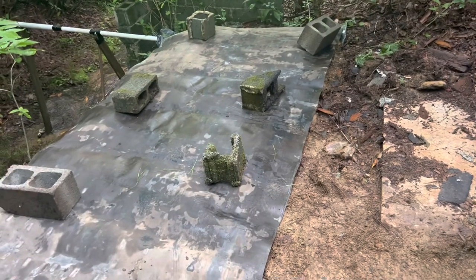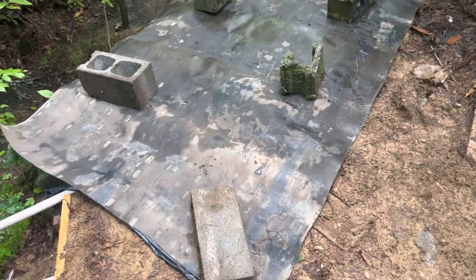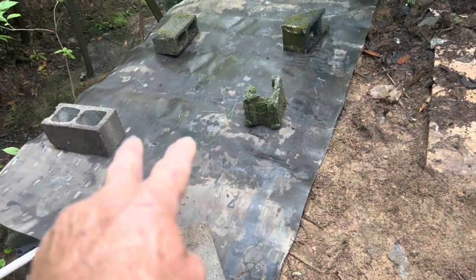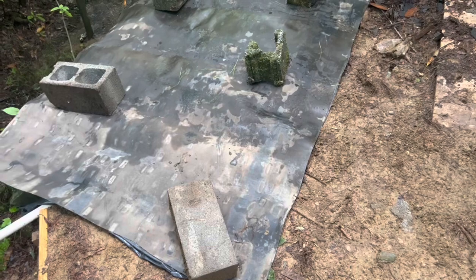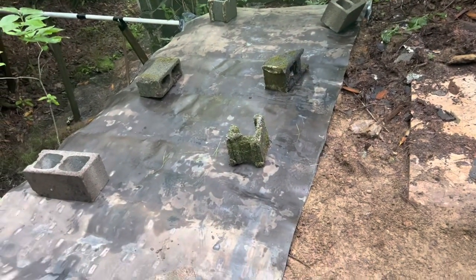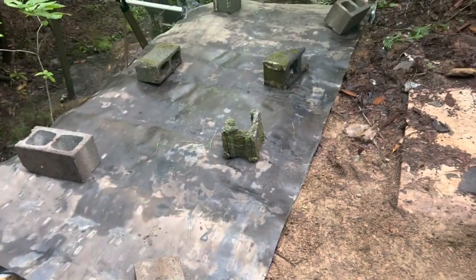I'm back here today regrading after six days of rain — about five inches. Hopefully all the trench ditches have settled down a little. I brought this 30-mil piece of vinyl roofing down — it's on top of the plastic. The plastic will do just fine, but tree branches coming down can pop a hole in it, so this 30-mil liner is a lot heavier. We took the cement blocks from the old pump house and weighted it down. This will be the final covering on it.